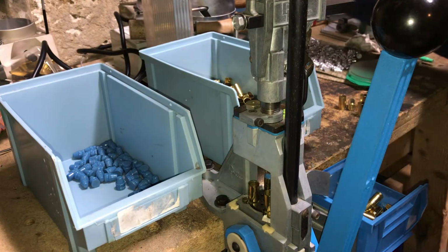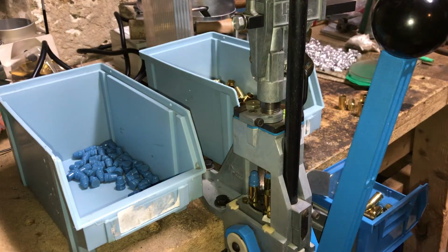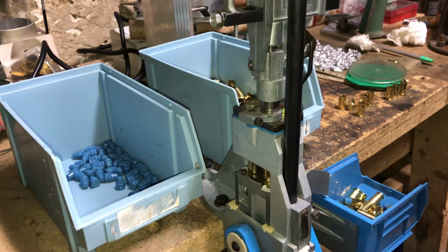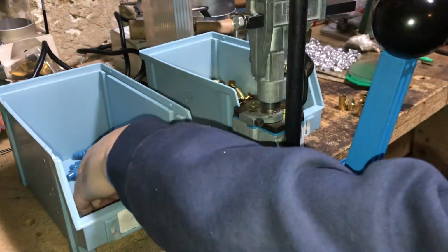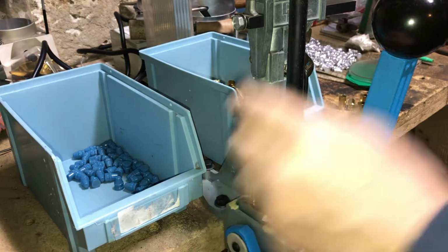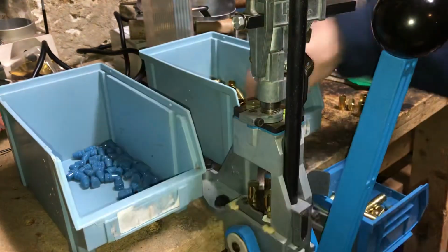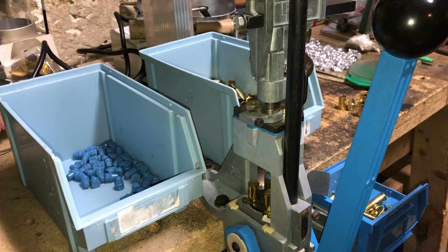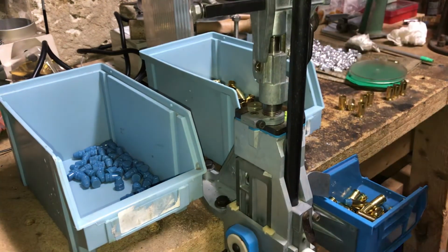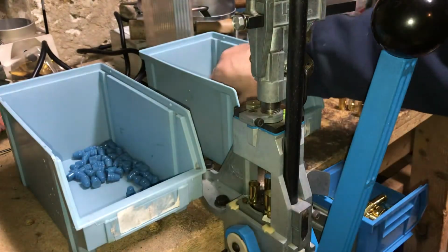You have to get it hot. It's a very hot mold. When you get the mold warmed up good, it gives me 5 identical looking bullets. If I don't get it real hot, I have to throw several away a couple times. What I do is I work 2 cavities, get it hot, go to the 3rd cavity, the 4th cavity, the 5th cavity. When I get to the 5th cavity, it is usually after 4 or 5 casts, and it's pitching 5 good bullets.